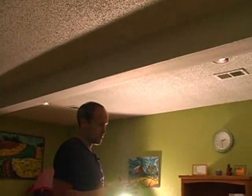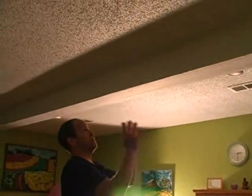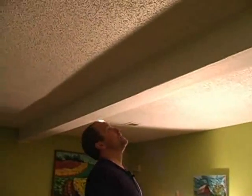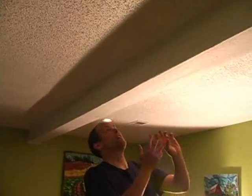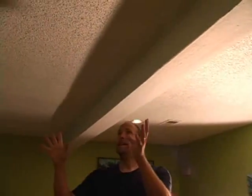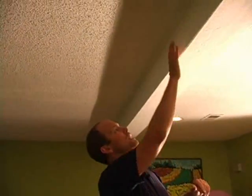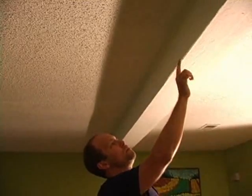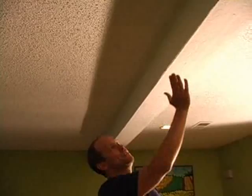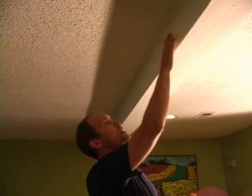A home inspector just can't come in and do an inspection of one system or component without thinking about the entire house. It's a dynamic situation. So really, you have to orient yourself. You have to figure out what are the key areas to look at. You have to figure out where, in this case, the deck is. And you also have to look with your eyes and figure out where things are and probable causes of water. So I'm going to get my moisture meter. It doesn't feel damp. There aren't any water droplets, but I'll get my moisture meter, use my infrared camera here.